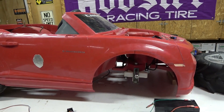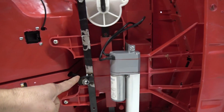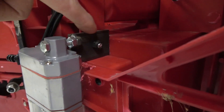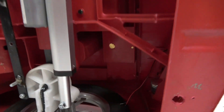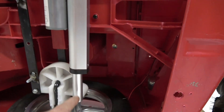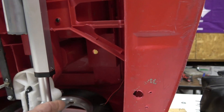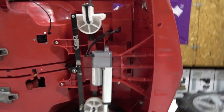Here's how the steering is connected. You can see the tie rod to the spindles — all stock. I already converted this to center steering because of the big tubs and the single center seat. It's a piece of flat bar with a nut welded to it to mount the base of the actuator. Most spindles have a wide plate, so this acts like a drag link — as it pushes, it kicks the back of the spindle and gives steering throw. You could change the mechanical leverage by adding another section for more throw.